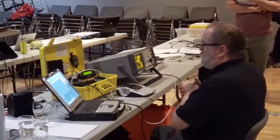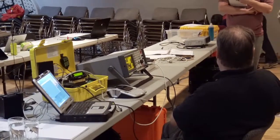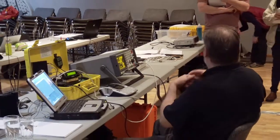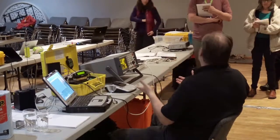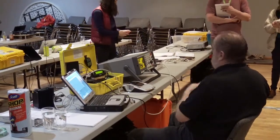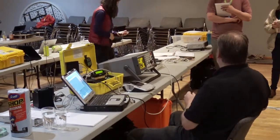This is just a terminal program. This happens to be PuTTY. And really all we need to do to get into the calibration mode is be in either simple terminal, Airmail, TeraTerm, PuTTY, anything terminal. It'll talk to the TNC at its basic level. So it doesn't really matter which it is, PuTTY or Airmail or what. It's all the same. It's just sending the command to the TNC saying, put it in the calibration mode.